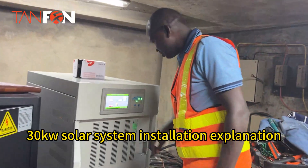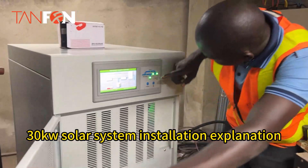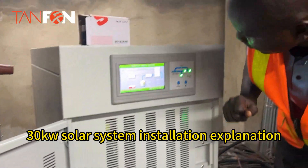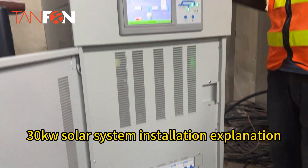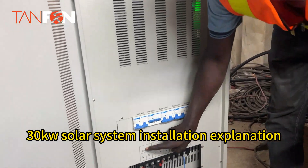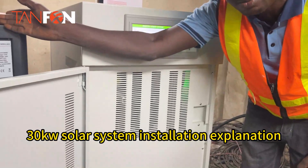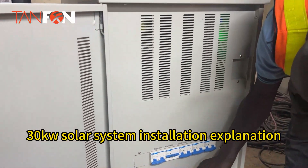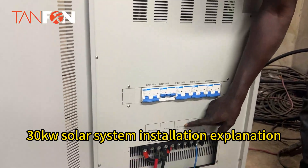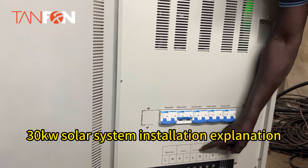This is our inverter, as you can see. The inverter is powered on. Active voltage is 227.7 volts and frequency is 50 hertz. This is the main switch where the utility CT power is connected to the inverter for charging — an alternative means of charging the battery. Power coming from the battery is connected to the inverter. This is a bypass switch: in case of any fault or if the battery is low, the bypass will automatically switch to supply power to the loads.